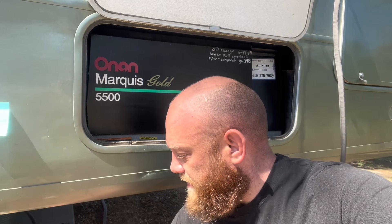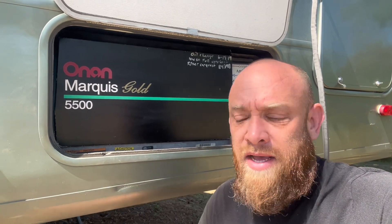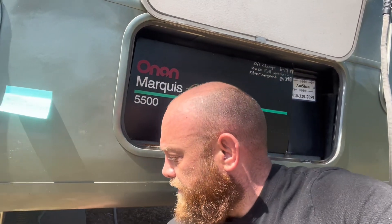After doing research, I thought the control board needed to be replaced, and we were this close to spending $680 on a new one. Then I got a hold of a Cummins service department and the service manager spoke with me on the phone for a while. I explained what was going on and his suggestion was to look at the brush block before replacing the board — a cheaper way to start.